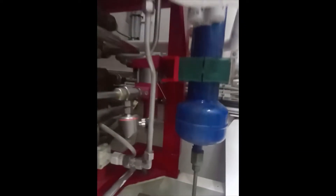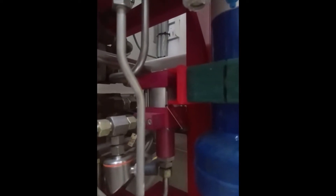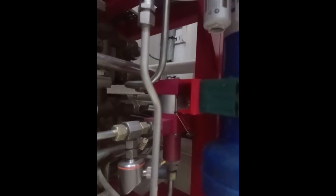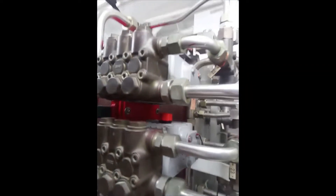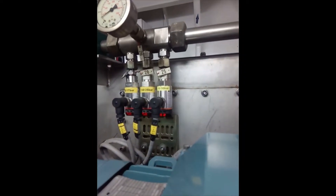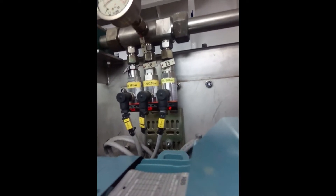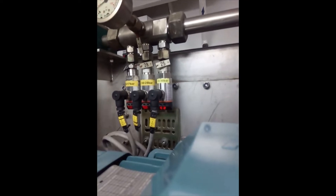Also on the system — in this case at the bottom — you've got what's referred to as a top-up water pump. The purpose of the top-up pump is to maintain a pressure of approximately 25 bar on the system, so that 25 bar is distributed right through the entire vessel all the way up to the nozzles scattered throughout the vessel.